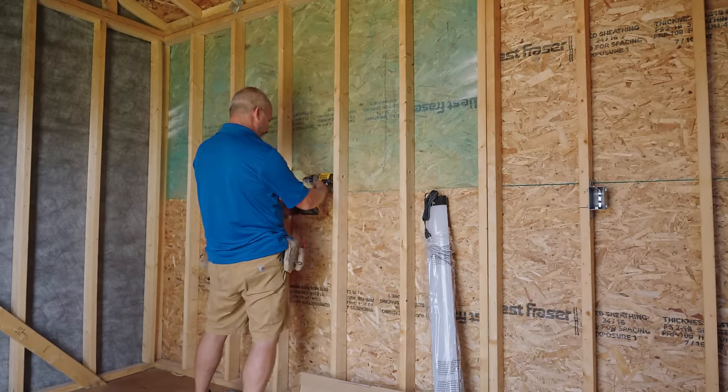Isolate the wires. This time, I'm going to be coming up, getting my screw. Always wrap it clockwise. Okay, and then drive that in. Done. That's the one downside in Canada. We got Robertson in the box, and we got Phillips on the fixtures. It's a little bit of a pain in the butt.